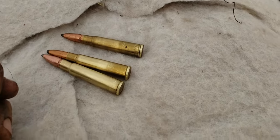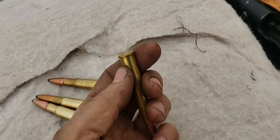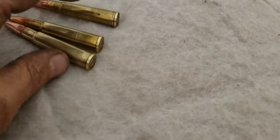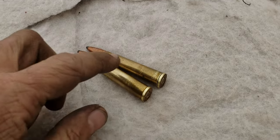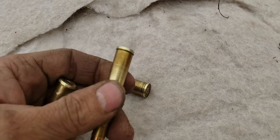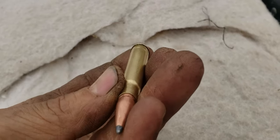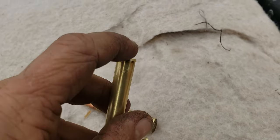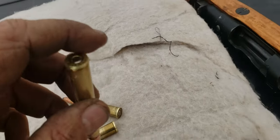That's what I've tried. The whole round will fit in the rifle with this rim on it, but the bolt won't close. So I took three of these — this one I hand filed, and then these other two I chucked in a drill press and used a file to turn the rim down. I didn't turn it down all the way. They seem to fit like this, but they didn't extract.